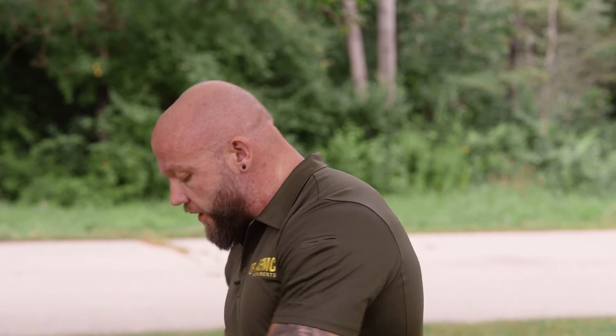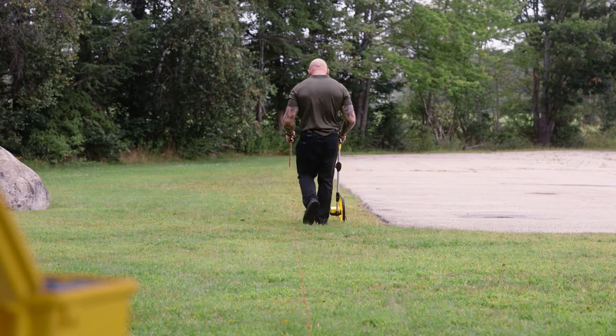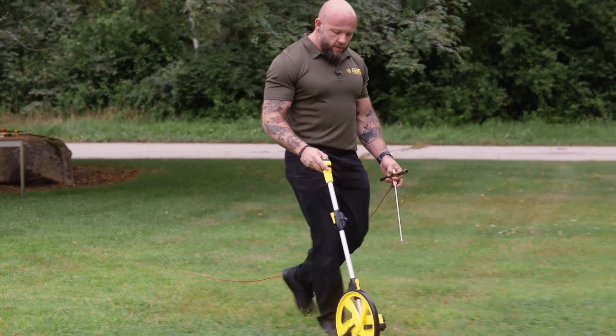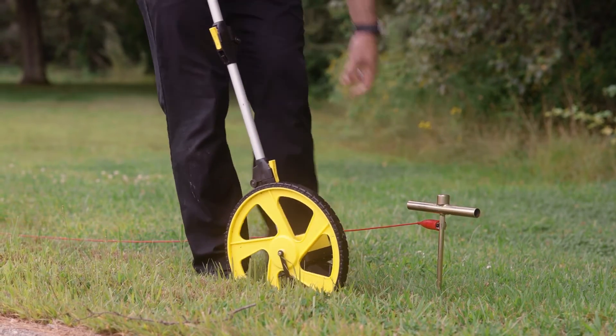As mentioned, we've already isolated our ground system for testing today, and it's about 15 feet in diameter — 15 feet from one end of the ground ring to the other. Following the rules of fall of potential, I need to go 10 times the length or diameter of this ground ring. So I'm going to take the red lead out and place an electrode in the earth 10 times away — that's 150 feet. That's my H electrode or red electrode, whose purpose is to inject current into the earth so we can measure resistance between our ground system and our S electrode or blue electrode.